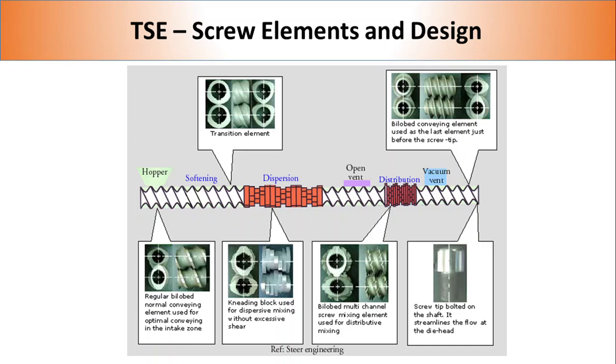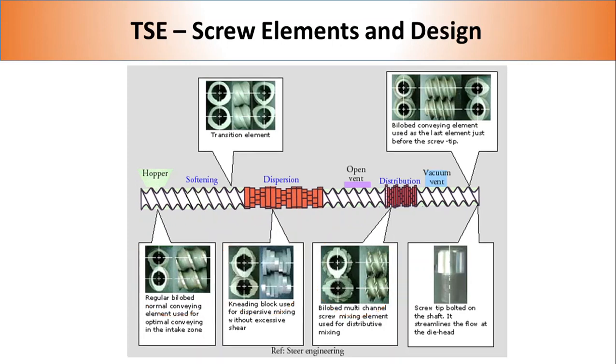The most common elements in a twin screw extruder are the conveying element, kneading block, and flow restrictor. The number and location of these elements can be easily changed, providing huge flexibility during compounding. Kneading blocks provide high amounts of shear, helping to achieve excellent dispersion of additives. However, if the polymer is sensitive to extensional flow, kneading blocks can be a problem. Flow restrictors reverse the flow of polymer melt, allowing additives to mix properly in the polymer matrix. Depending on the difficulty of dispersion, a typical twin screw will consist of one or more sections of kneading and flow restrictor blocks.